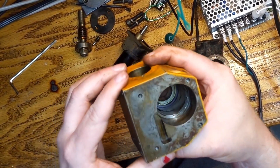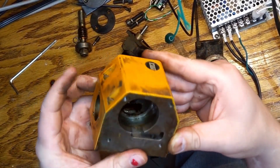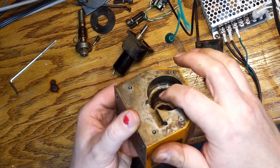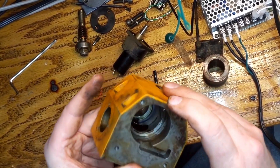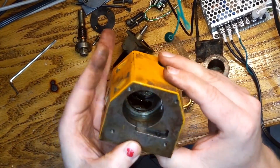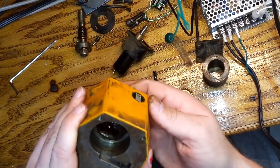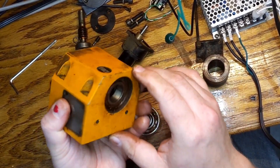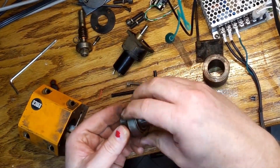Maybe this was done differently at some point. There's an oil groove in here way down — actually, never mind, it's just grease. It looked like an oil groove but it's just grease. Now these — are they the same as the spindle bearings? No, they're not. I think I might just get new bearings for this, get the number off of it. They are definitely rough.